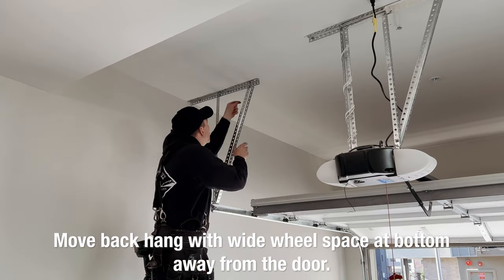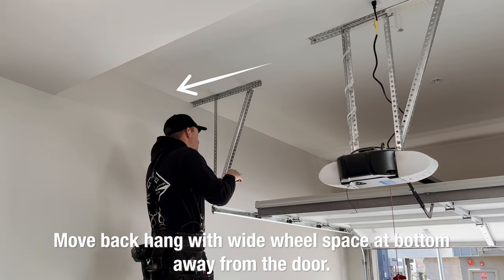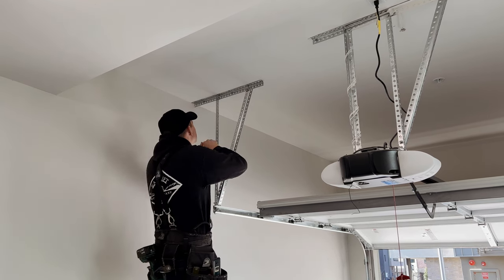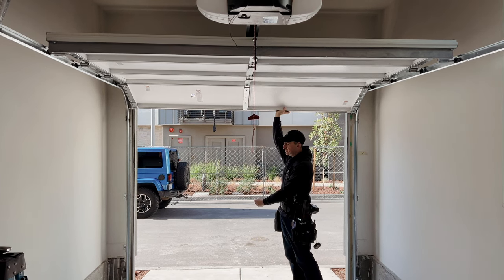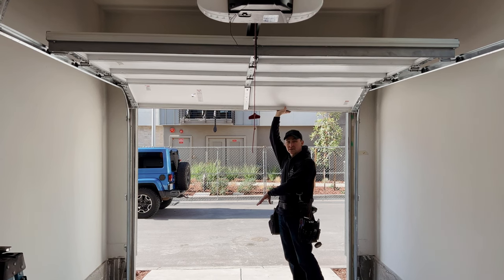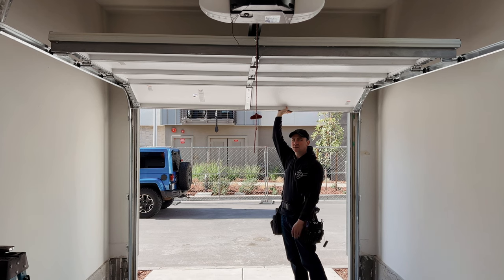I'm going to start with just two holes on the punch angle. Now, every time you make an adjustment to your backings, because you already brought in the vertical track at the bottom and your door is centered every time it closes, you can close the door — it'll act like a reset — then open the door and see if you still need to make any more adjustments on your backing.